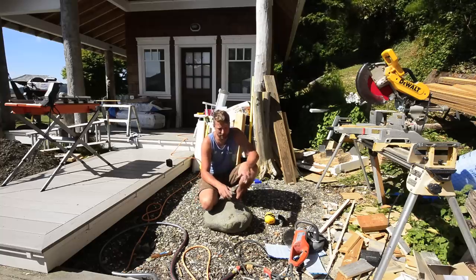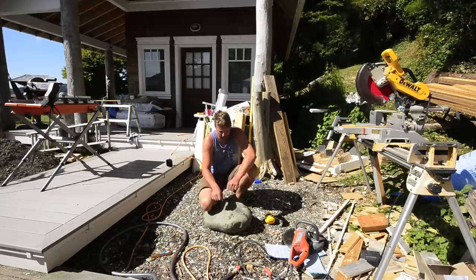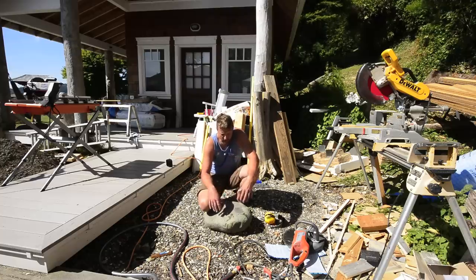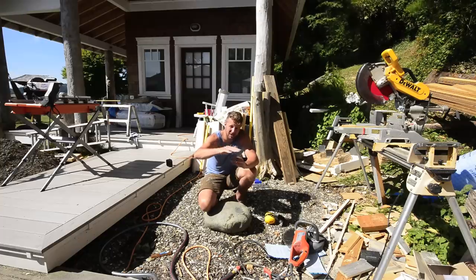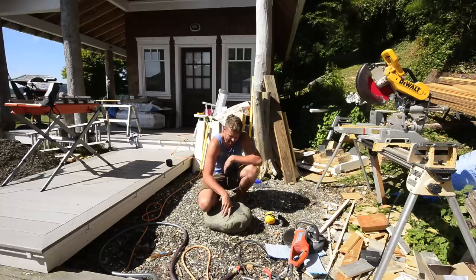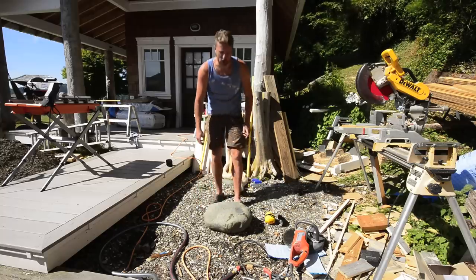And then I got a 4.5-inch diamond wheel for my angle grinder, and I'm gonna just grind it smooth with that. First things first, I need to take this into a darker spot so that I can see my laser level, and I'm gonna lay this thing upside down and mark a flat laser line around the outside of the rock with a Sharpie so that I can cut a flat spot on the bottom so it sits nice and flat on my countertop. So let's do that first, and then we make some noise.